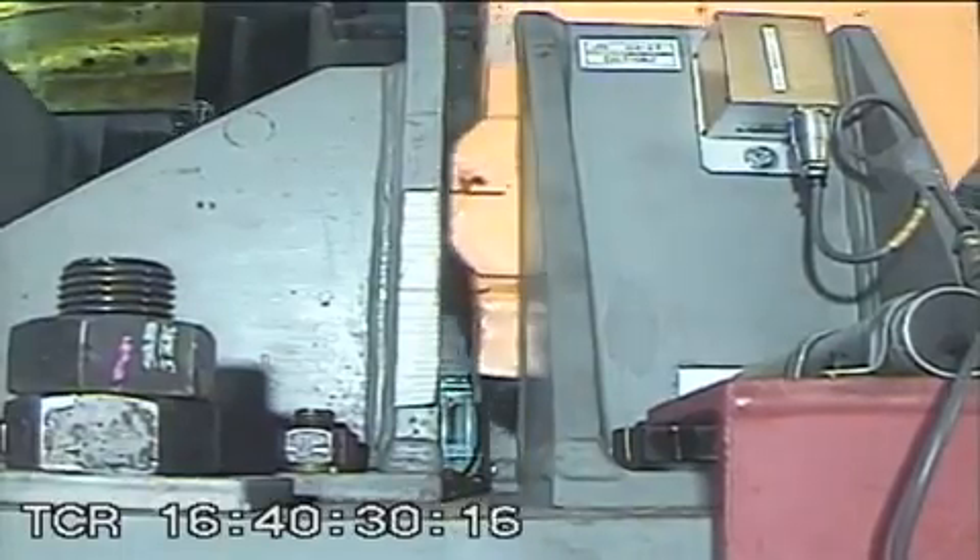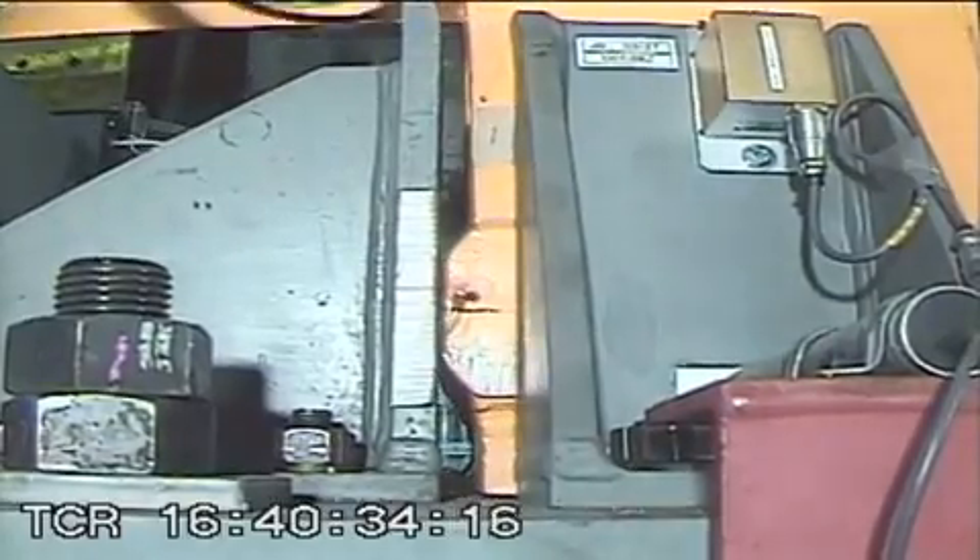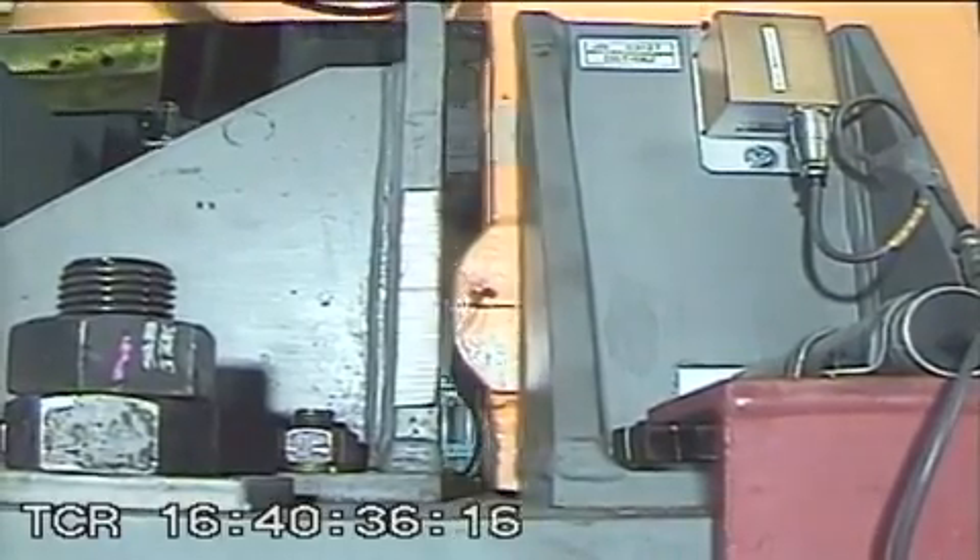This rocking frame is a little bit different in that it moves laterally, but it also rocks upwards. So if you happen to be standing next to the rocking frame, you're going to feel the floor around you being lifted up, because the column is rocking upwards — and that lifting up might be on the order of three or four inches in some of these extreme earthquakes.